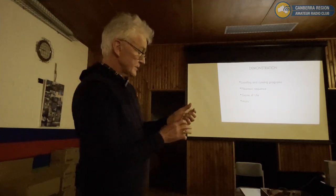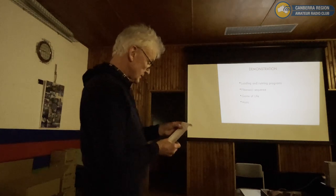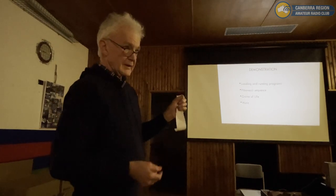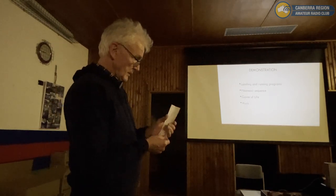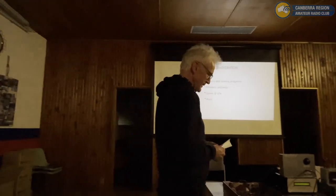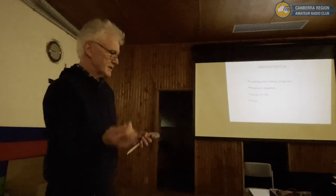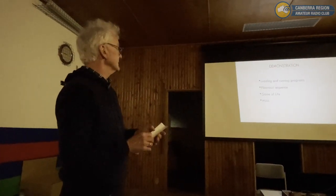Is the printer an 8-bit parallel load? No, it's just TTL serial. I now have a version that actually prints it out in decimal, but it takes two machines to do it. This machine does the calculation and then sends it to the other machine, which converts the hex to decimal and sends it back. It's all a bit bizarre, but it does work.